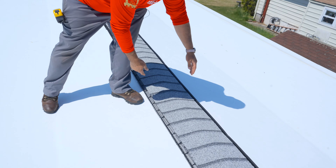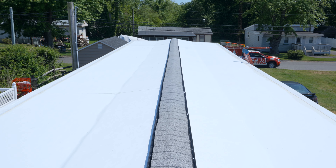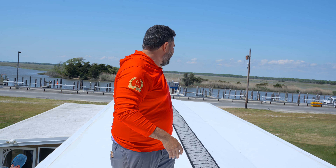Also, at the last second, we installed the ridge vent all the way across. Why? Because that creates the final point for proper ventilation — air comes in and escapes through the ridge vent. We put it end to end.